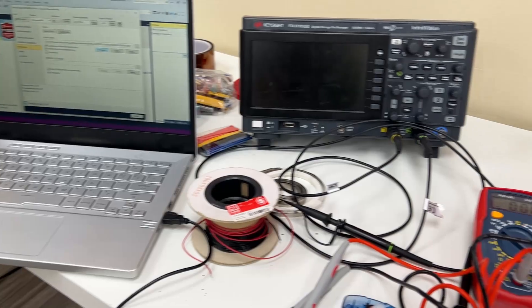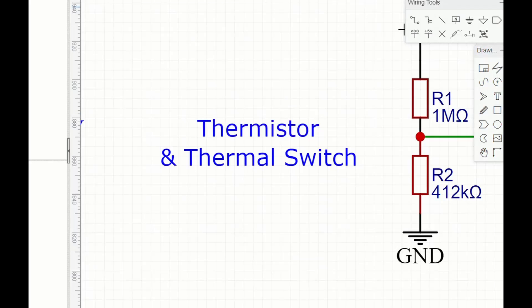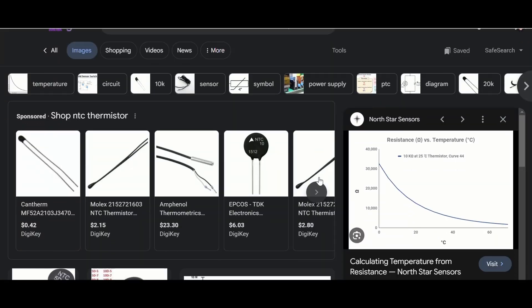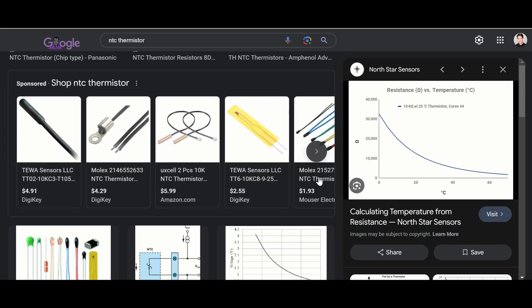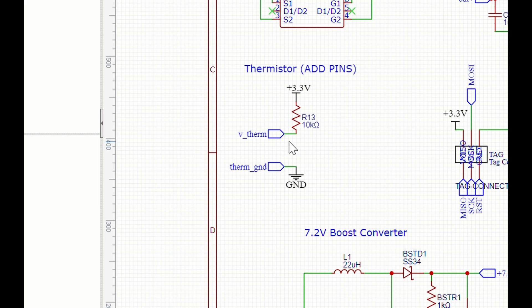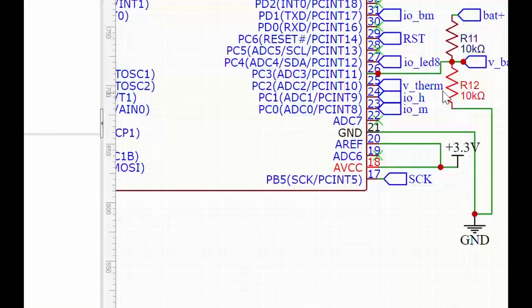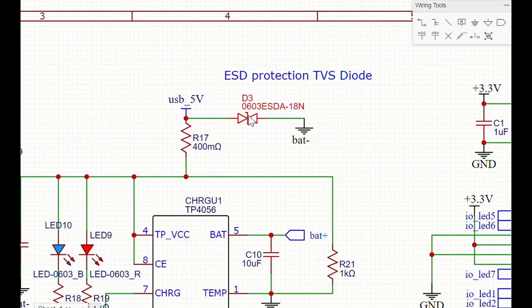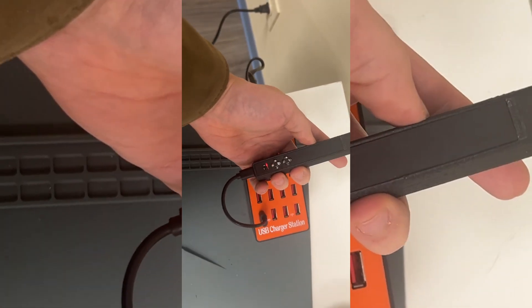We're so close, but we had to make some serious changes to the circuit design because without proper temperature sensing you either can't get hot enough or you get burned. The plan is to use an NTC thermistor, which is basically just a resistor that drops resistance a lot when it heats up. We set it up with a voltage divider and therefore can measure its resistance drop with our microcontroller, which also gives us a great temperature estimation. We also added anti-electrostatic discharge protection — ESD protection — so our circuit board doesn't fry if it gets a static shock from something like the USB-C port.